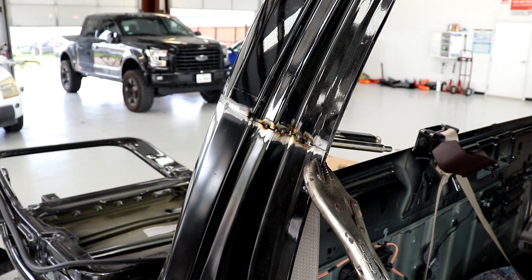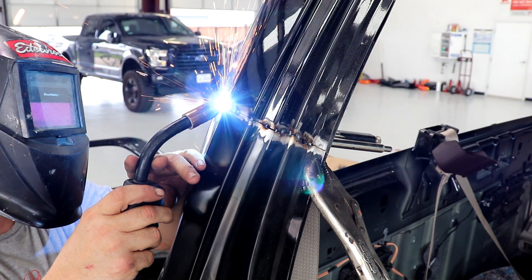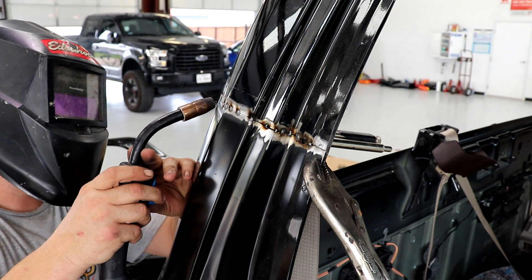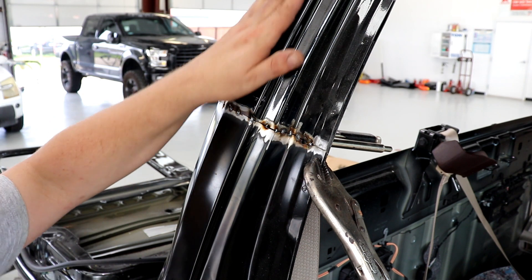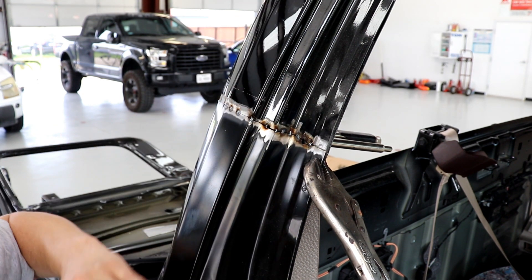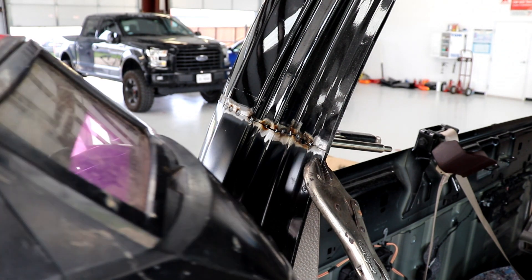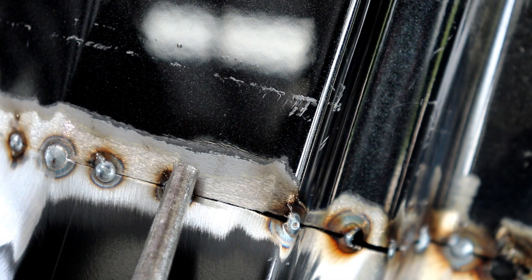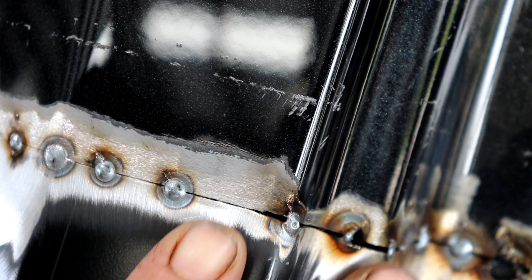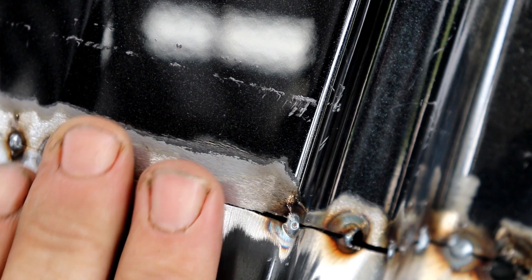Sometimes you can give it multiple pulses. You've been told don't heat the panel up too much — and you're absolutely right. That's all you want to do. Leave it alone, let it cool down. All you guys know that the temperature it's going to take to warp or change metal is going to be that temper line. The heat only traveled to that ring and then it stopped — it's warm out here but it ain't warp warm. Now it's cool enough to where I can just put my hand on it, and that's just about 10 seconds after I've welded. Don't stick your finger on a weld.